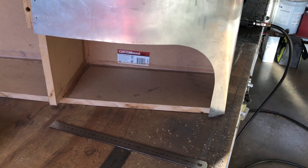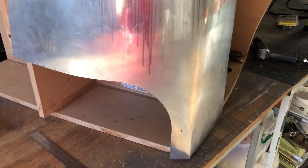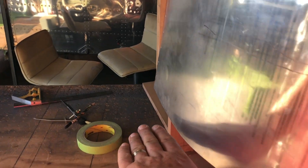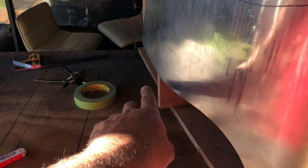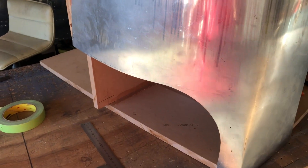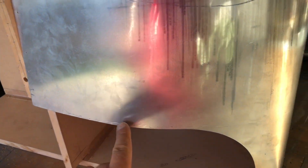I've got my little cutout for the air exit — it's just sitting precariously up there at the moment, not clipped on. It'll go straight through there and then you've got an air radius there, but we've got a curve like that. So when I go to flare it, it's not just going to be a simple flare here — the angle is going to constantly change all the way around like that. So I want a 20mm edge and it'll fold up about 20 or 30 degrees, but we have to change the angle the whole way around.